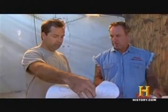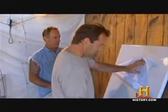The last thing we've got to do on this popcorn machine is the artwork on the body. So I called my pinstriper, Ted, and he's got a great design all sketched out. Sketch out how you want it to look. Sketch it on there with a pounce wheel. It's a little gizmo with sharp little spikes on it, and you just roll. Trace around, it actually perforates the paper. And then after the holes are punched in it, we take a little bag of powdered charcoal. Same technique that Michelangelo used on the ceiling of the Sistine Chapel, it's that old.